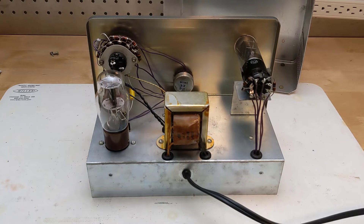Looking inside, the circuitry is quite simple. It uses two tubes, one for the power supply rectifier and another for the eye tube. The power supply tube is an odd choice, a 1626 triode rather than a true rectifier tube. With the grid tied to the plate, it acts as a diode. Heathkit often got good deals on surplus tubes, and apparently the 1626 was a popular military tube used in radio transmitters. Heathkit was likely able to buy a large inventory of these after the Second World War on the surplus market.